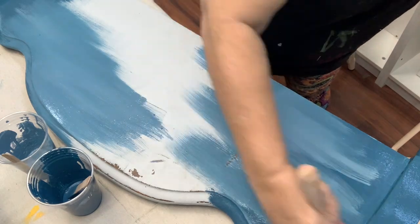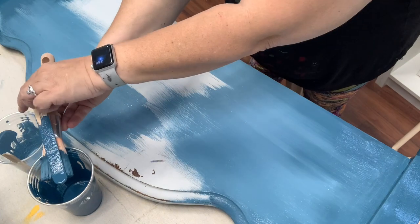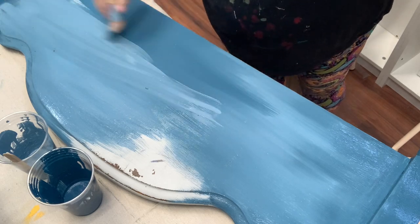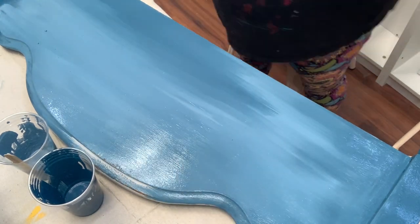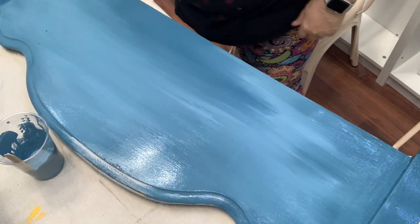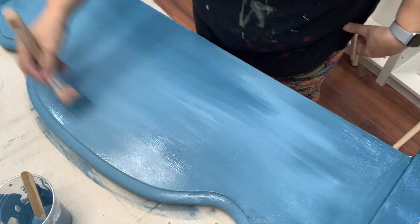They are super soft and they do a great job of holding a lot of paint despite their size, and I'm going to use them in sort of a blending effect. This is going to be a very basic blend — really it's barely a blend, it's just sort of a mash together of the two colors so that they feed into one another. As with most paints you'll want to apply two good coats of Miss Mustard Seed Milk Paint — the color is really luscious and it's got a good consistency. The thicker your coats the more likely you are to have chipping and cracking. A heat gun is also a great tool to force cracks and chips.